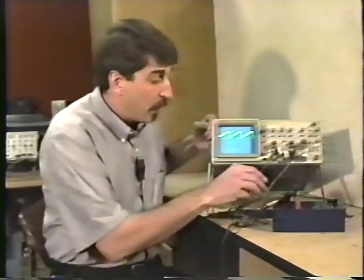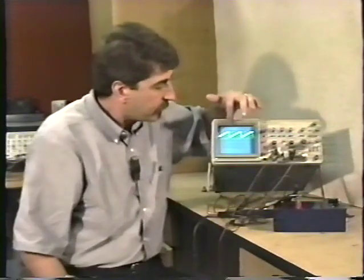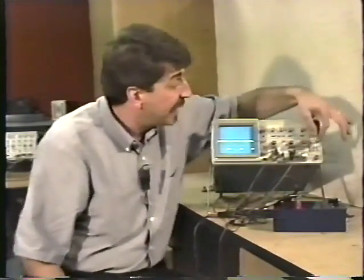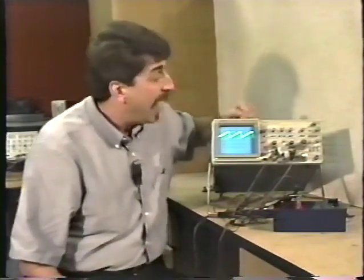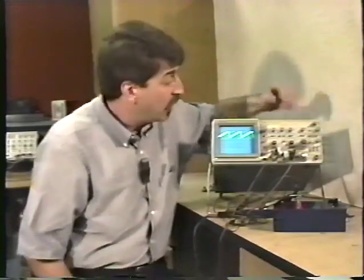It doesn't matter what we're looking at on channel 1 now. We can do whatever we want with channel 1, and the oscilloscope will remain synchronized on whatever's coming in channel 2. So you set the sync using the level control on channel 2, the sync input is down here, and you can do whatever you want, scoping various parts of the monitor, different circuits on channel 1, and you will not have to readjust the level control or adjust the triggering in any way. It doesn't matter what you're looking at. If the source is set on channel 2, that's what the scope is triggering on, no matter what we're showing here on the display for channel 1.